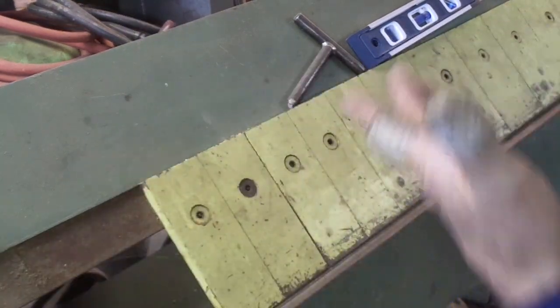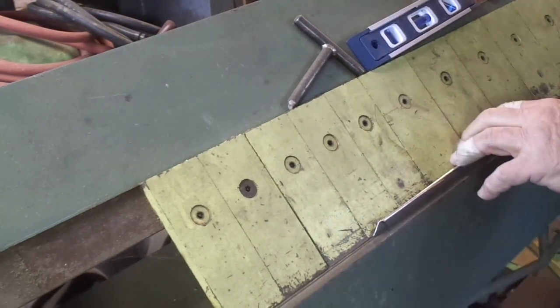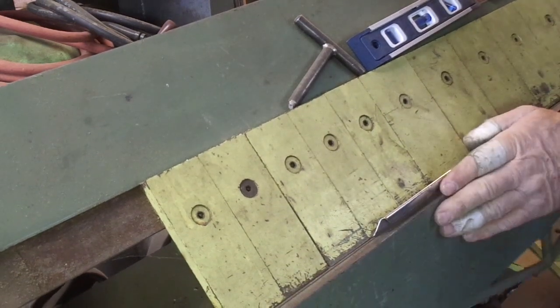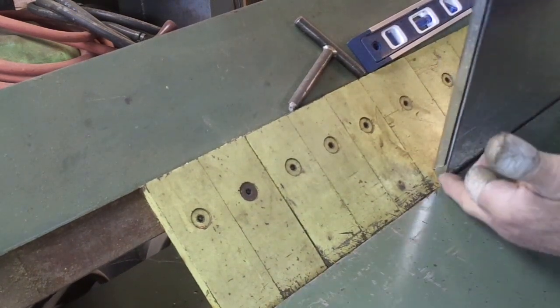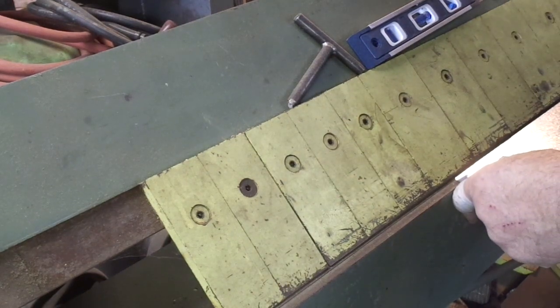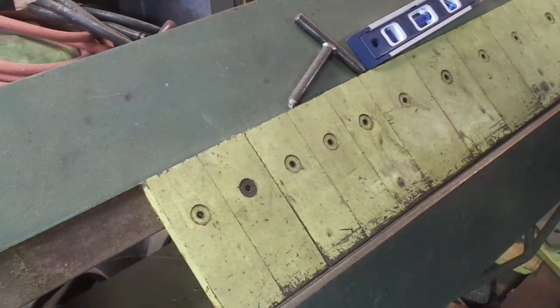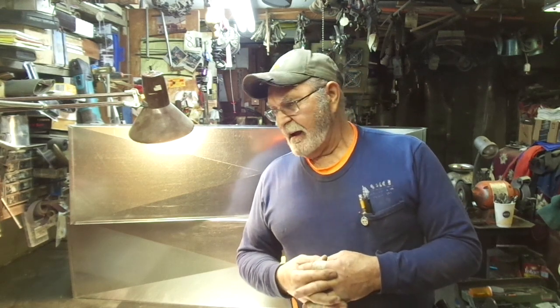I'm here at this little brake — not because we need it, but because it's convenient. I'm just going to slide this right in here. We're going to come up to that right there and roll this up to 90 degrees. Slide that out and roll that up to 90 degrees as well. This is where those angles come in handy — come into this one inch mark right here. You can fold it up to 90 and because of that angle it doesn't interfere and doesn't crinkle up here. Save yourself a little bit of time straightening something out before you assemble it. Except for filming with the camera, this is literally 60 seconds to make an end cap — another quick and simple little job. I just got to run over to my buddy's garage and throw it up in the attic. This is Tractor Man 44 and I am out of here.